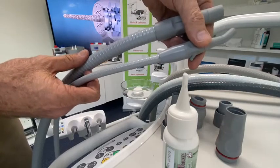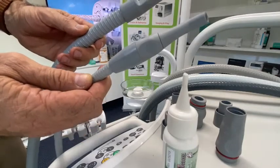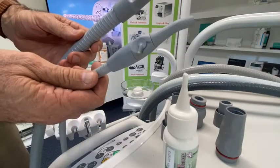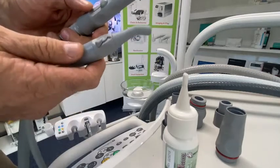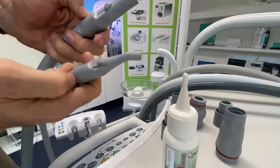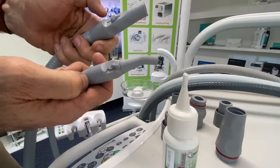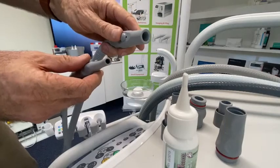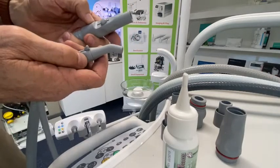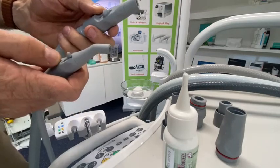Smaller tube, smaller flow rate. You will always have a smaller flow through a smaller tube, so you will never get the same flow out of a large tube. If you want a similar even flow, you'll have to open the small tube to full and back this one off maybe to halfway until you get an equal suction through both. That's the way the Belmont chairs are designed — it's just following the laws of physics that gives you two different levels of suction.